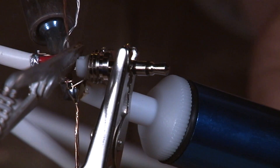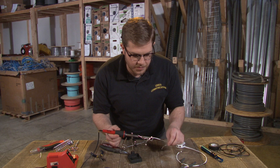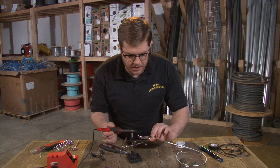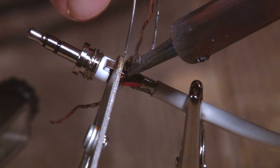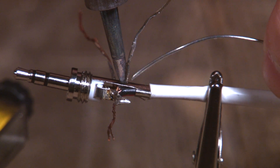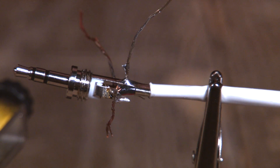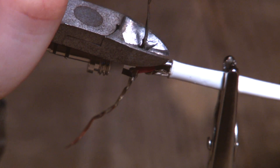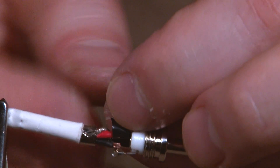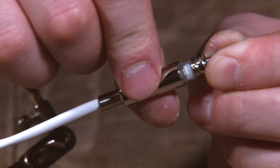If one of the solder points are bad, you can start over by using the solder sucker. Be careful when you remove the heat sink — it could be hot. Place it on the middle lead and repeat the process. Twist one or both grounds together and insert into the ground. Solder into place. Check to see if there are any shorts. Trim the excess wire and any strands that were missed. It's not a bad idea to add a little electrical tape to prevent any future shorts. Clamp the ground lead around the wire. Pull up the cover and screw on.